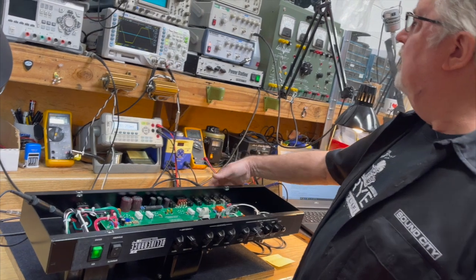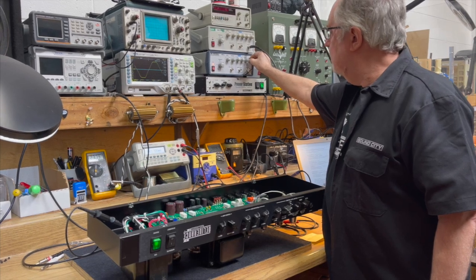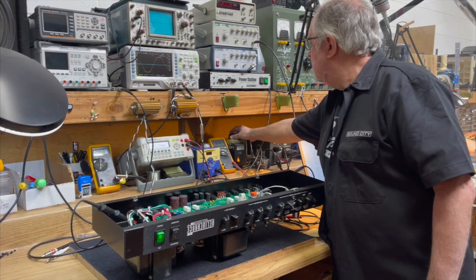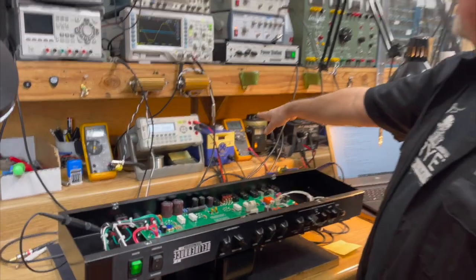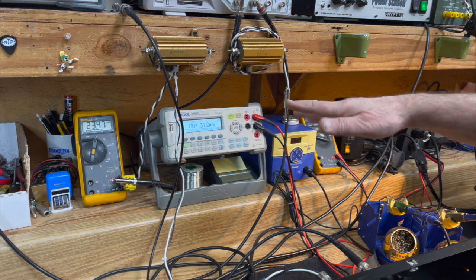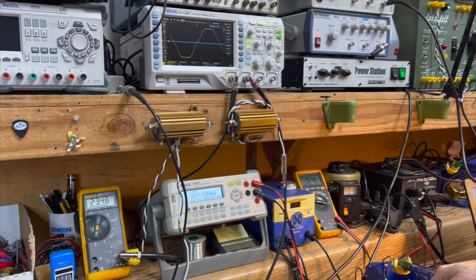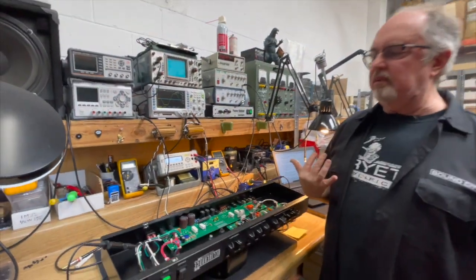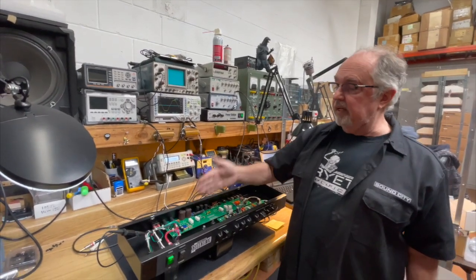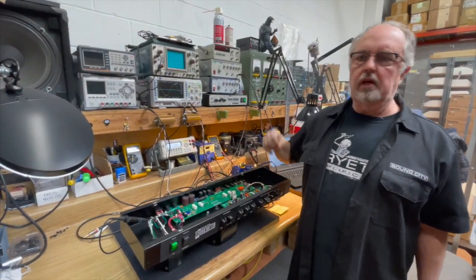We're at the point where we're at 97 volts before the regulator dropped out, and we're at about 55 watts roughly. We have nice power amp saturation there. If we wanted to variac this all the time, I would run the variac at 100 volts, just call it 100. And then I would go back in and bias the tubes so that we get rid of the crossover distortion at that setting.